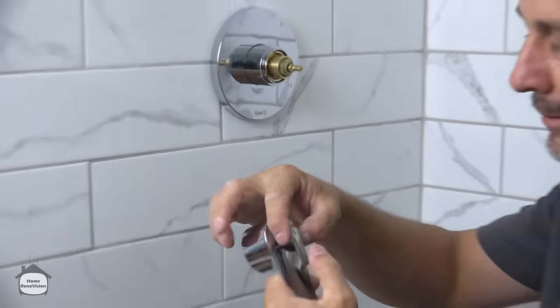And then, now this is how we do this. Thermostatic valves have a maximum and a minimum. And what you want to do, just for simplicity, is have it pointing down, just for design, just aesthetic really, in the middle temperature, not at the hottest, because you'll find that that's about where you're going to want it anyway.